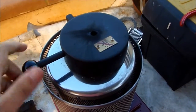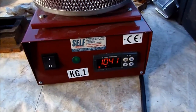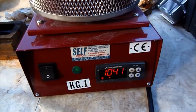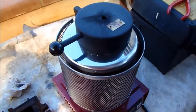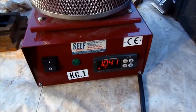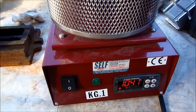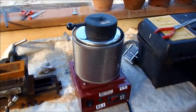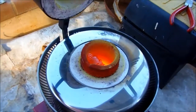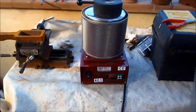The temperature will rise up to 1085 degrees Celsius — that's the temperature at which copper melts. But I prefer to set up the furnace to the maximum temperature it can reach, because we have more power to melt down all our alloys inside. So we have to wait. The copper is melting slowly, but it's going all right, very well.